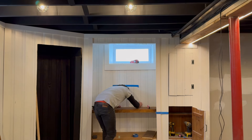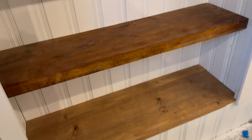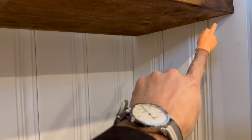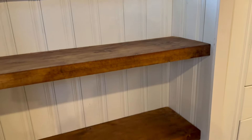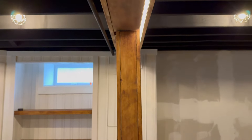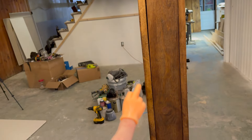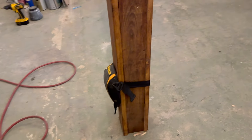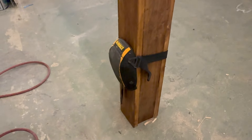Making sure our level is solid — and would you just look at that golden oak finish? I love what stain can do for a piece of wood. What I've done is measured up my 60 inches, ran my tape lines so I know where to properly poke a lag into that and not have a bad time. Here's what the shelves look like — free floating. Nobody wants to see your brackets, nobody wants to see your hardware supporting it. You want to look at it and be like, how does it float there? It's just secured on the sides.